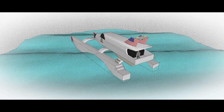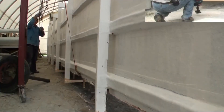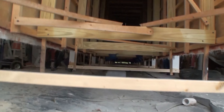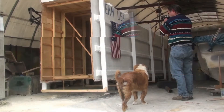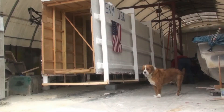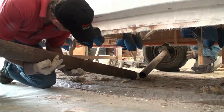Today is a rather exciting day after a lot of hard work over the last couple of months, getting enough money together and enough time and material to start building the mold. First we built the plug. The plug is a quick replica of what the boat's going to look like — in this case, a sponson. The plug is built upside down on the ground and then they fiberglass over it. Today's project is to pull it out and separate the mold from the plug.